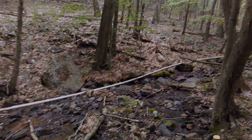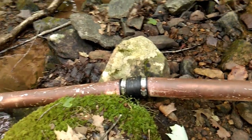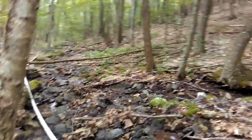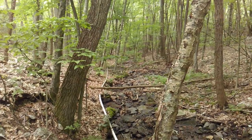I built in essentially a whole series of soft joints, so the pipeline will blow itself apart without damage. I found some heavy duty reinforced cooling hose made for bulldozer radiators that fits my pipeline perfectly. I just have four hose clamps holding each of those joints in place, so that if anything happens — if I have a water hammer or some other issue — it's just going to pull itself apart without destroying hundreds of feet of PVC piping.